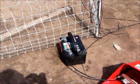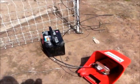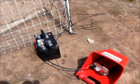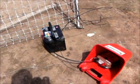If one of the wires touches a fence post or metal, you can have a dead short where you get no power through the fence. When the voltage starts to get down around two or three thousand volts, it's usually time to move or adjust the fence so the voltage won't drop too low.